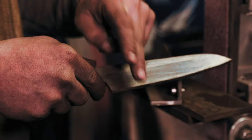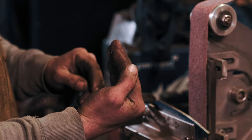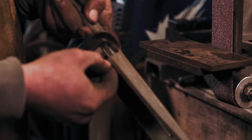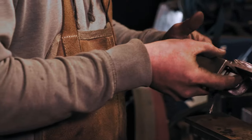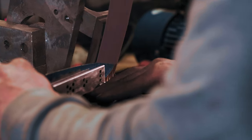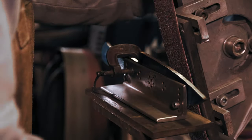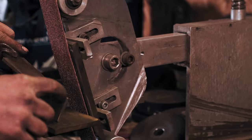So to be doing the chisel on this side, we'll flip it over, hold on this side and clamp it on. And then we'll angle the platen of the grinder. We'll keep adjusting that slightly once we get nearer. I'll probably get really steep to start with, take off some of this material. Before I attack it and ruin a belt, I tend to grind most of this bevel on a worn out belt that way up - I'm not shearing all the nice little grit off of my belt. Then go at it this way and do all the finishing grinding, hopefully up to about there. So we'll angle this one over - it's really steep to start with. That's in preparation for grinding this chisel.